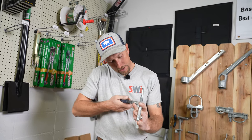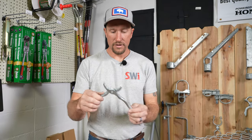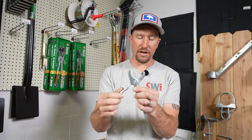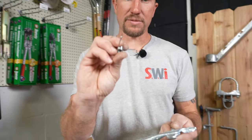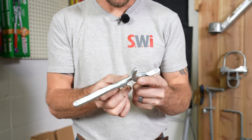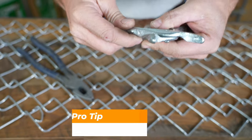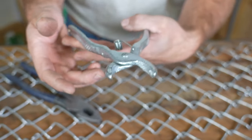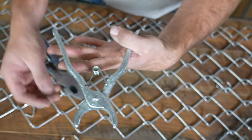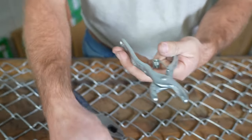Some people don't like that, so let me show you another thing. If you take your pliers and pop that spring out of one side, you can go back to the standard set of hog ring pliers. Or you can flip your pliers over and put the spring in the opposite direction. What that spring will now do is pinch the hog ring pliers open, so when you compress your hog ring, that spring is going to reopen them so that you don't have to open them yourself.